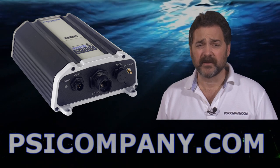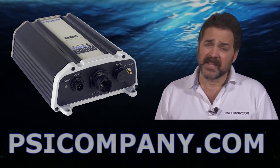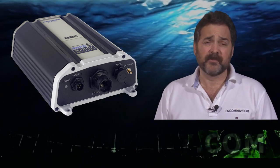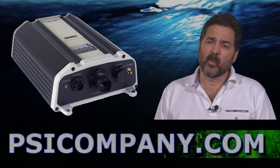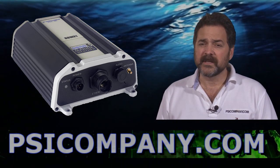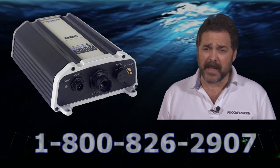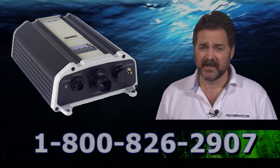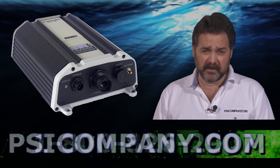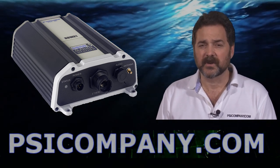Furuno has incorporated the BBWX1 to work in its Furuno NavNet VX and NavNet 3D networks. There are a couple things you need to know though. If you're going to be using the Furuno BBWX1 Weather Sensor in a NavNet VX network, you will need to have the 10.4 inch display that incorporates the CMAP Max style charts — that ensures complete compatibility. If you're operating Furuno NavNet 3D and have the charts come from Furuno, you won't have any issues. It's designed to work completely.